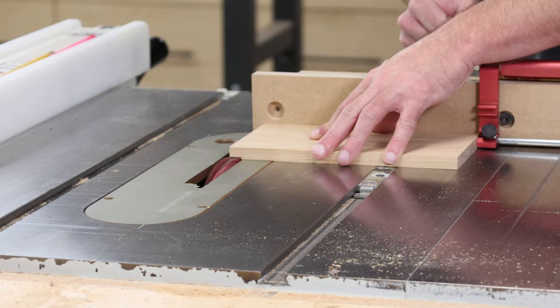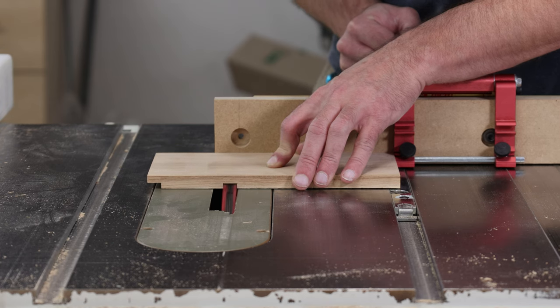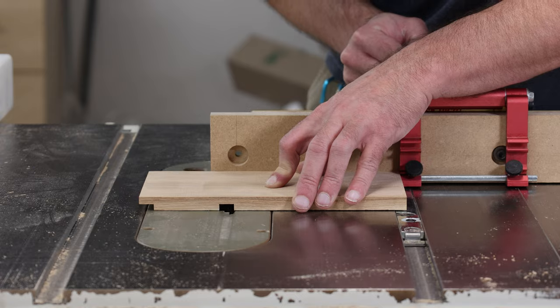I'm going to go simple with my joinery — just cut some channels across the sides for all my pieces to fit into. I have a dado stack in my saw, so I should be able to cut each one with just one pass. I only need a few cuts: a rabbet along the bottom and then three dadoes across.